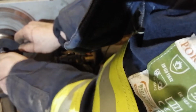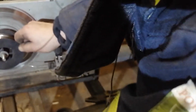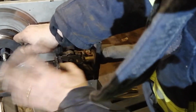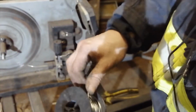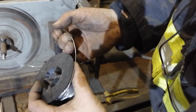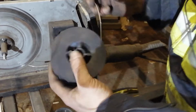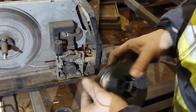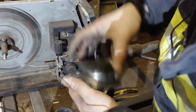Oh, we don't lose them. We take off the small spring and washer. Different welding machines can have slightly different combinations, and we slide the spool off. Normally all portable welding machines accept both mid-size and small size. The small size is not always possible to use with non-portable welding machines. They probably need a rebuild because a big hub comes there. Okay, we can bend the wire a little bit and put it on the shelf.